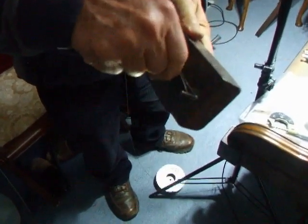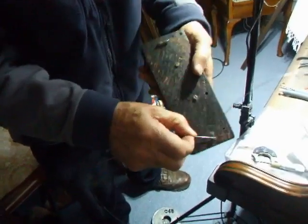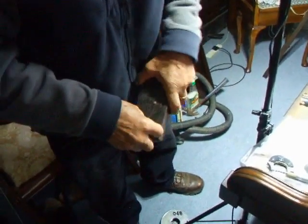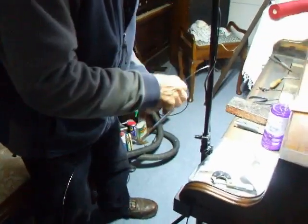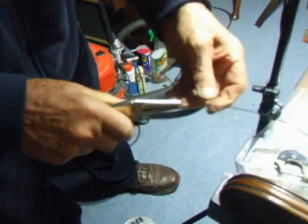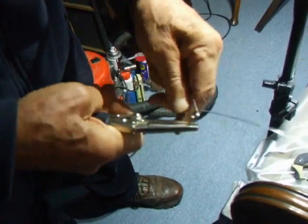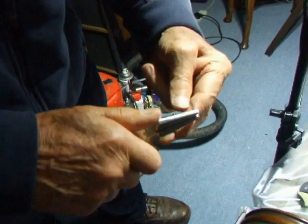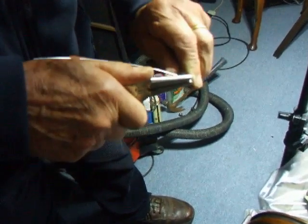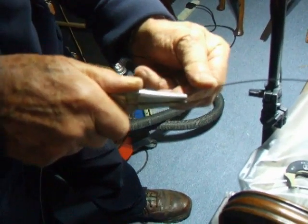In the case of Broadwood, this is going round twice. Some manufacturers make it only go around once. Maybe it saves string, I don't know. So there we are, that's the beginning of it. The next part, next phase, is a bit more complex. I have to carefully bend this tail around the actual string twice and close to each other. The windings must be close.